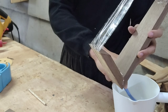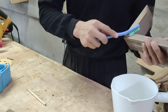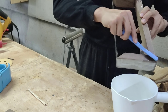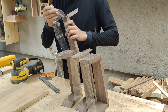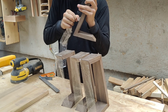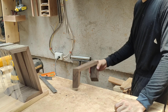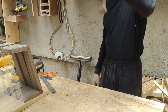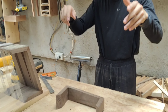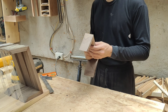Of course, I'm going to clean my glue — those of you who don't clean your glue, shame, shame, shame. Just clean your glue. One more reason I cleaned the glue in this particular build: it is so hard to remove dried-up glue on those angles; it's a very tight spot and the glue cures very hard. So clean it right away while it is still liquid. Here is the drop test, strength test, durability test — judge for yourself. I'm not going to put excessive force because carrying a headset doesn't need a hundred pounds of weight.